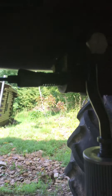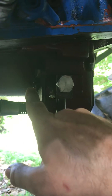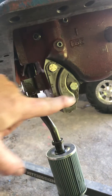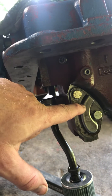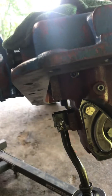Now this is your razor — this is your raise — and your unloader valve is right above it. This exhaust plate here, you pull it off, there's a plug right under this port. It takes a 3/8 fine thread — pull that plug out and then you can pull that unloader valve out.